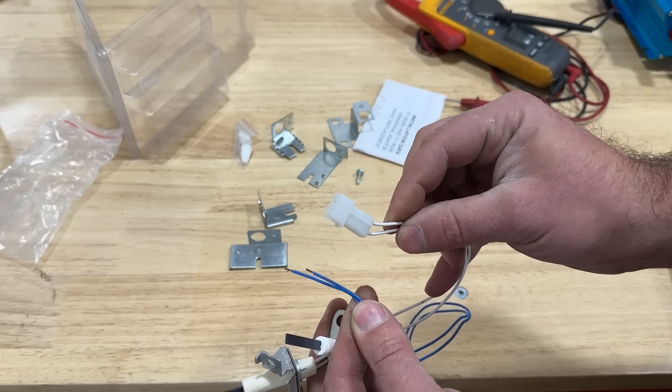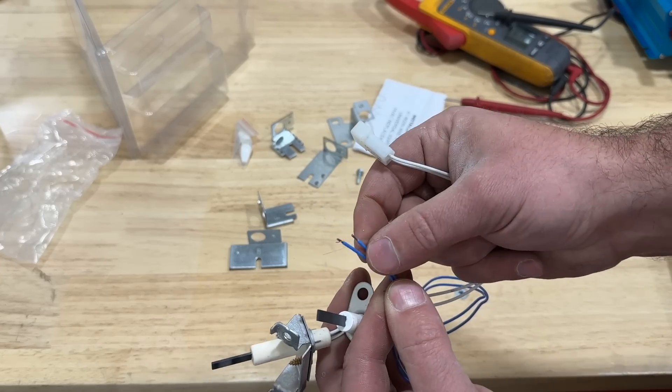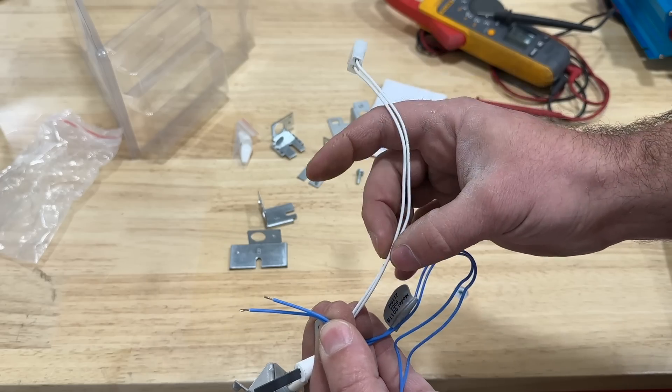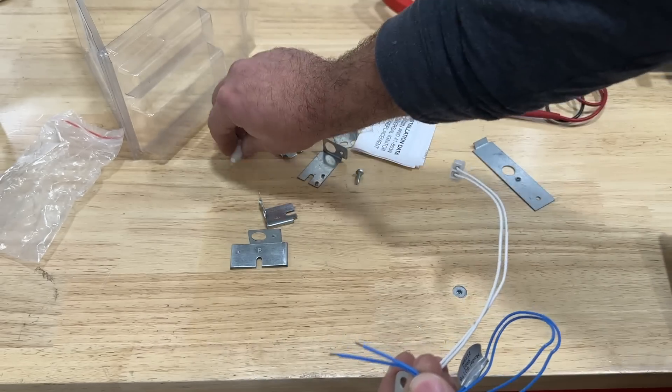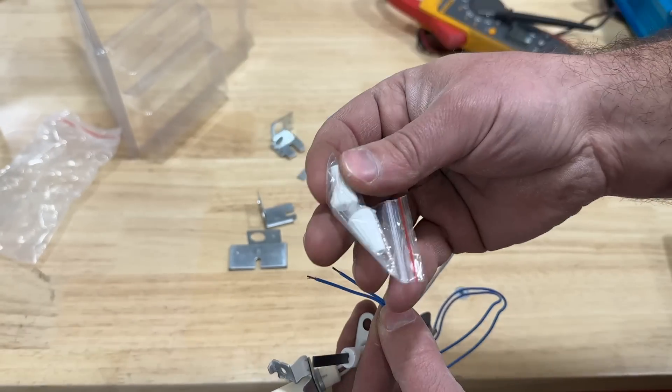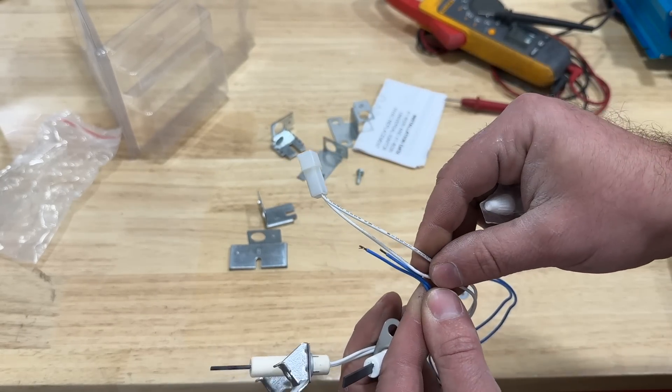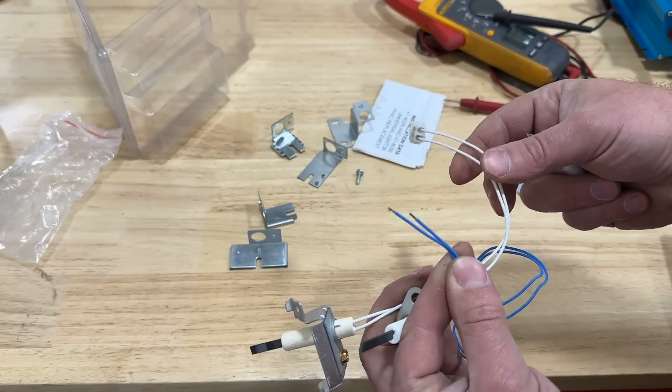In this instance we want to plug this into our furnace, but this just has two bare wires. If this was actually bad we would just snip it right here and use the ceramic wire nuts that it comes with — they're heat resistant. Tie them together — polarity does not matter — then reattach it.